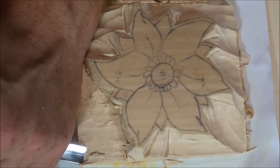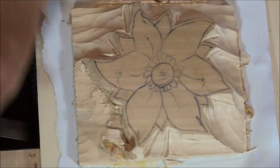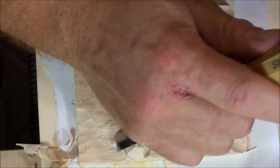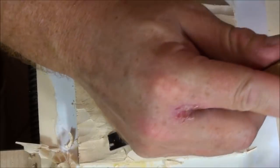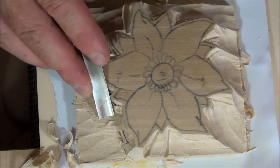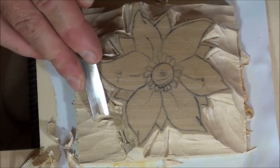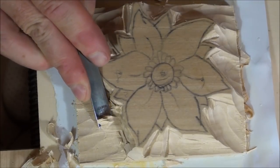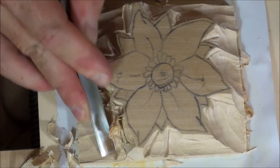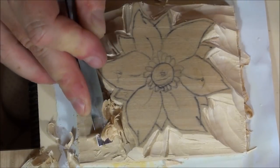So we just clean a little bit. You see that here I'm against the grain. When you are in this situation, maybe the best thing you can do is to make some cuts cross grain, by slicing the tool. This will leave a much cleaner cut, even if you are not cutting along the grain.